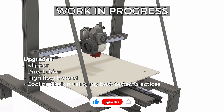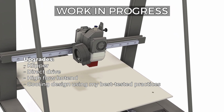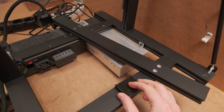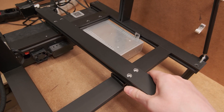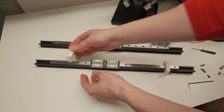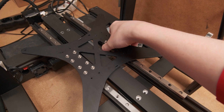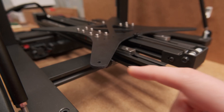So if you are in a similar boat, make sure to be subscribed, as in a future video I will finish this 3D printer overhaul with Klipper and other upgrades to see exactly how much speed and print quality we can squeeze out of it. But going back to this video's topic, making a linear rail modification is not that hard if your 3D printer is made from standard V-slot profiles. In my case I had to lift the middle part by around 10 mm with printed spacers, use M3 screws with non-rotating T-nuts to attach two MGN linear rails to V-slot profiles, then secure the heat bed bracket to the carriages and use printed corners to attach the profiles to the main frame from both sides. Aligning everything will take the most time, but when done right you will end up with a very smooth and rigid assembly.